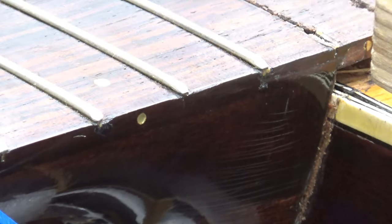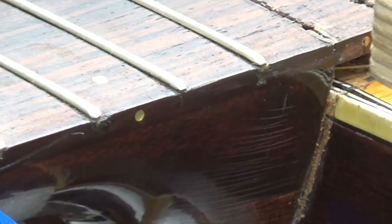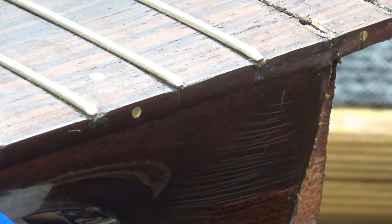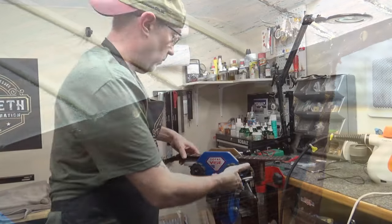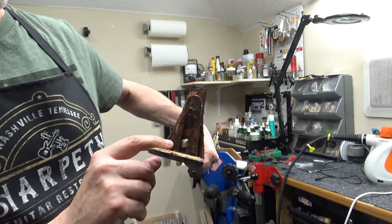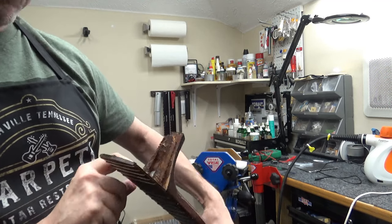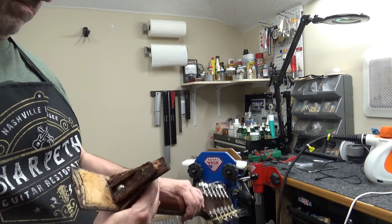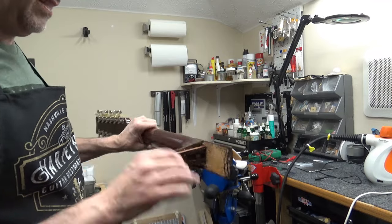I ended up using the StewMac heat stick after all. After that hide glue warmed up and softened, I was able to drill the bigger hole and stick it in there along with the smaller ones. I used a little bit of steam too. I went around one more time around the heel with the Exacto blade and cut a little bit more. And finally — here we go. It looks like hide glue. There's a lot of spruce on there. And there are lots of little stress lines in it. You'd normally think hide glue would be easy — wrong. It's not the prettiest looking dovetail right now, but we'll do some finish repairs on the cracked finish before we put it all back together.